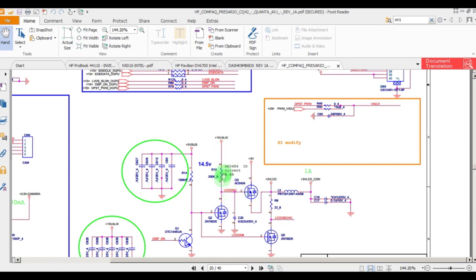This gate is driven by 15V and there is a 330K resistance here for current correction. I have only 2 components which I suspect are causing the problem: C20 and Q2. I asked to replace these, but first the capacitor is easier to change. These small-value capacitors — 0.022 microfarad — are causing problems most of the time in circuits.